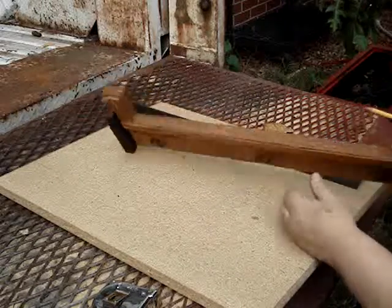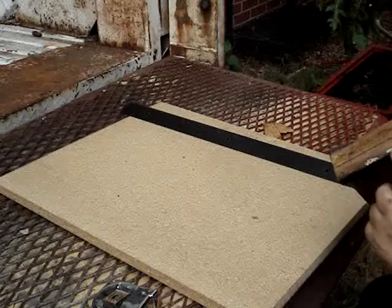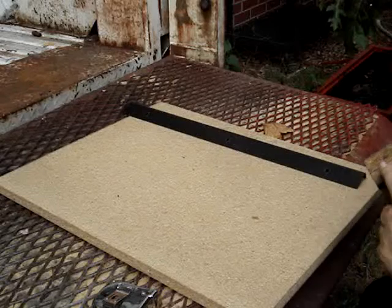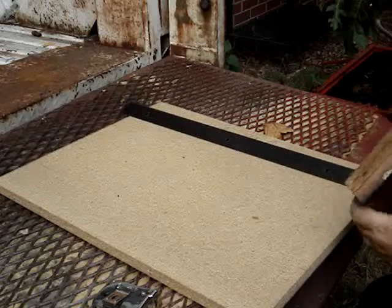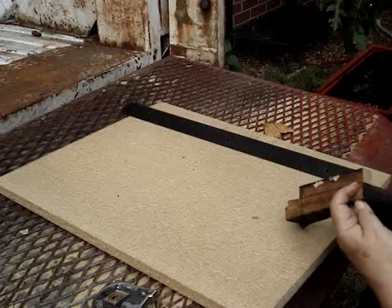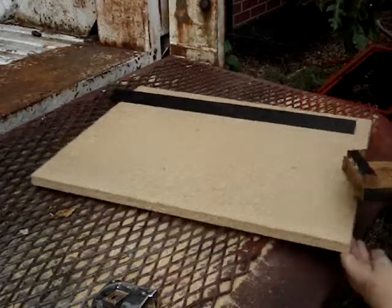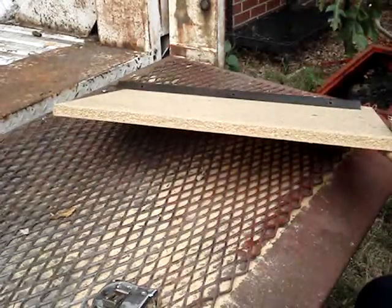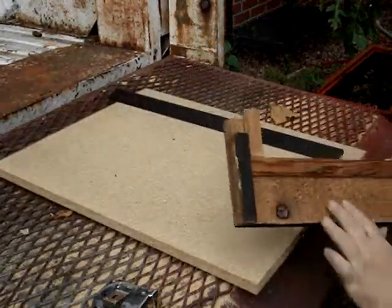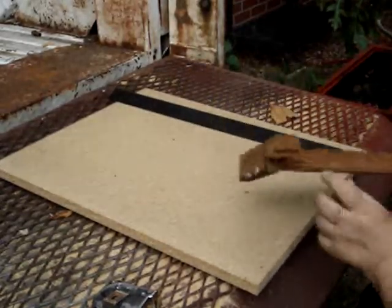So I decided to go ahead and pull it loose, and this side was already unglued too, but the staples were still in it. But it easily pulled right out. You can see where it used to have glue on it right there, and it didn't stick. So it also appears that this piece of wood may have been a little thicker than 3/4 of an inch. It's actually thicker than this, which is 3/4 of an inch, but not by much. 1/16 of an inch maybe. So that may be due to swelling, because it looks like it has got water retention and swelled up, and we know this side has.